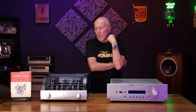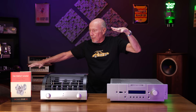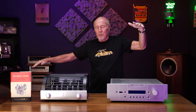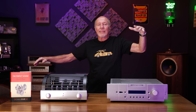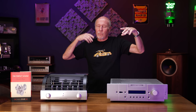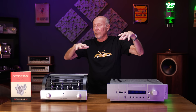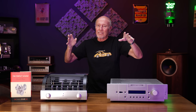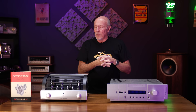How about cables? If you have a high output impedance preamp going into a lower input impedance power amp and you're doing it with a 30-foot cable, you want to be careful. You want to check the capacitance — picofarads per foot — and make sure it's low capacitance if you're running a really long cable. But we can help you with that. Typically it's really not an issue.